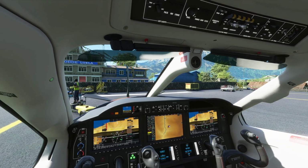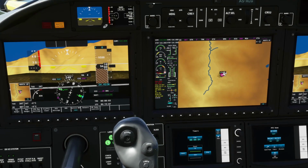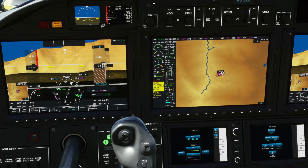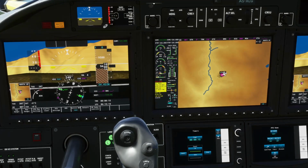Okay, so let's go to the overhead panel. We're going to move this to the start position for 2 seconds, and then we'll start the timer. 1, 2, start the timer, and we're going to monitor the NG and confirm engine rotation, which it is. At 13%, we're going to move the throttle to the low idle position and continue to monitor. You notice the starter there, which is on. NG 30% before 30 seconds, and now we're looking at 52% and watching for the starter to go off.